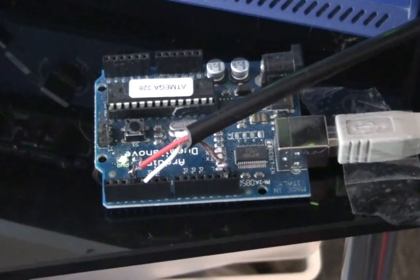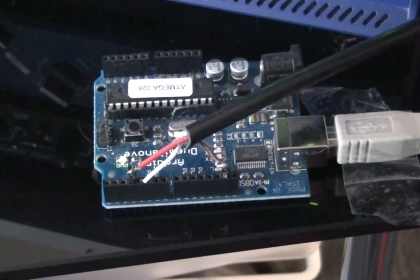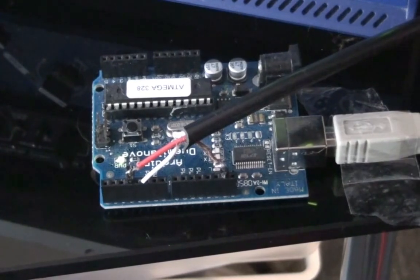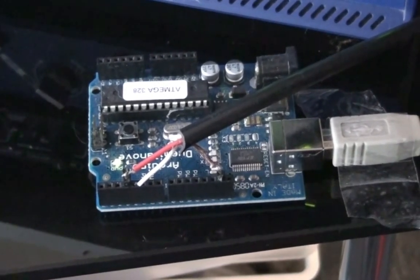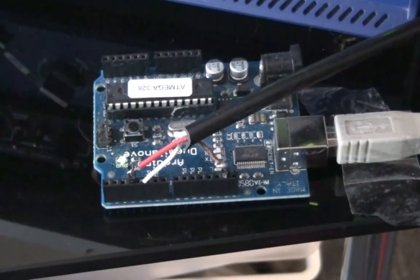What we've got here is an XLR cable plugged into an Arduino board, with the red pin going into pin 3, the white pin into pin 4, and the copper braid plugged into the ground pin. Then plug the other end of the XLR into your DMX lamp.